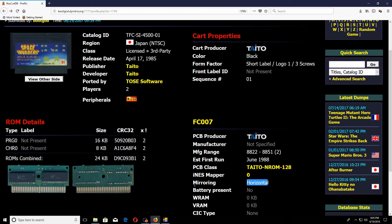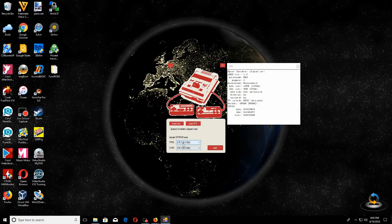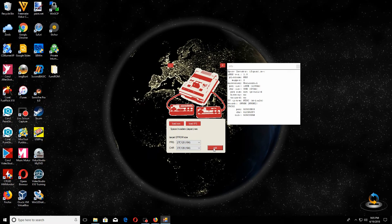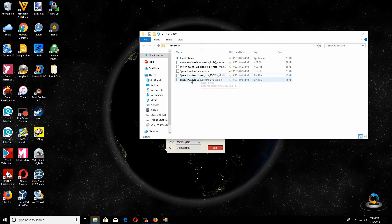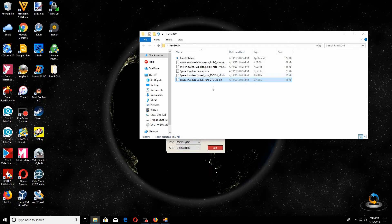On the NESCart database, Space Invaders shows the PRG sizes for each, confirming it's basically a 24K game. Notice it's a mapper zero, and once again — horizontal mirroring. Remember, horizontal is very important. This is only for N-ROM and other boards; not all boards require this. Now that we chose 27C128 for each one, we click Split. Once that's done, you'll see two new files: 27C128 CHR and PRG. The X2 means you just duplicate the file twice to fill up the whole chip — nothing changes, it will work fine. With your program of choice, you can burn each EEPROM into its corresponding chip.